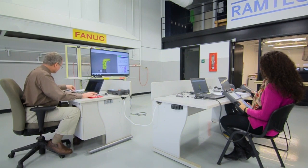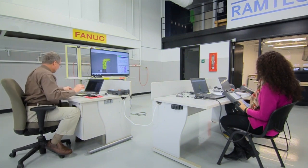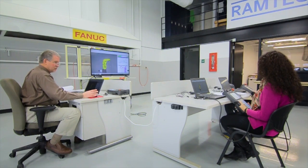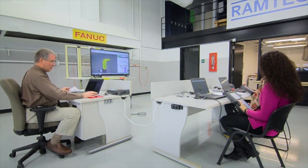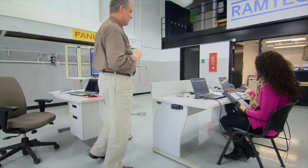Turn in your book to page 83. You're going to power up the robot and jog it using the joint coordinate method. Power up the robot, change the speed to a safe low speed — we can use 50 for the simulator — then jog the robot using procedure 6.4. The book has you go back to page 69 for procedure 6.4. Turn to page 69 and start stepping through the lab. Go ahead and do the coordinate key to get into joint jog, then hold down shift and move speed up to 50%.